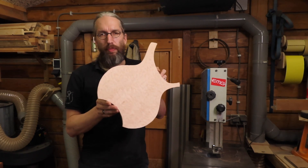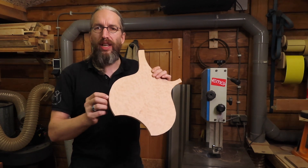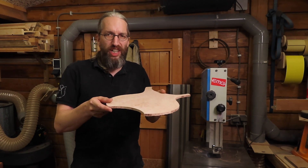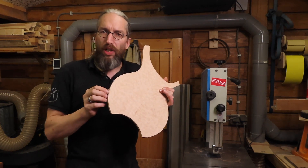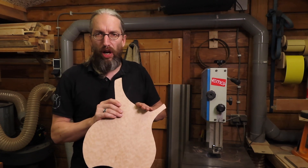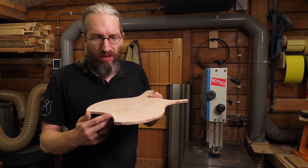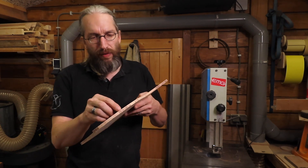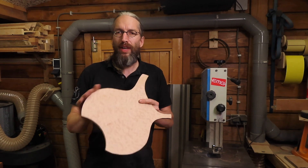Here we've got our nicely cut-out top. As you can see, I always leave one or two millimeters of an edge between the actual line and where I make my cut — don't try to cut too close to the line because with this highly figured wood on my bandsaw it wanders just a little bit. But don't leave too much wood between your line and the cut either, otherwise you have a hard time sanding your top to the line, and there's a high chance of tear-out if you're going to use a router table. I generally keep between one and two mils. Let's stick on the template and clean this one up.